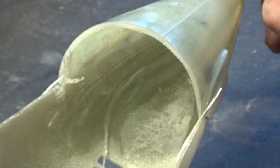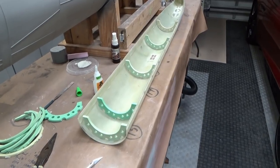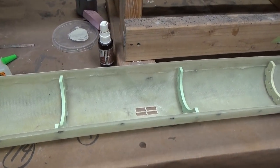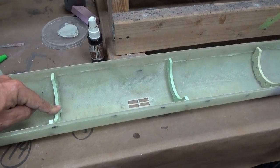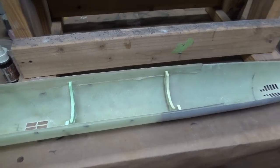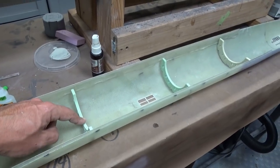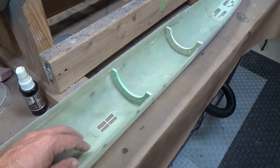Our objective is to completely wet out that cloth so it is completely saturated. I've gone ahead and started installing the supplied bulkheads into the lower hull. In terms of measurements, I wanted all bulkheads based off the position of the watertight cylinder — in this case a 30-inch overall length. I measured the exact center of the boat, went out 14 inches to either side, which allows a one-inch overhang to set up hold-down hardware. I marked out the rest of the bulkhead locations and tacked them in place with CA glue, ensuring the hull was roughed up with coarse sandpaper for maximum adhesion.